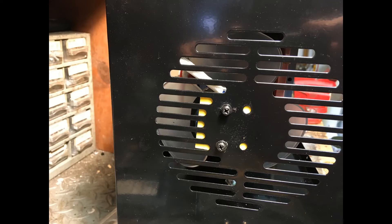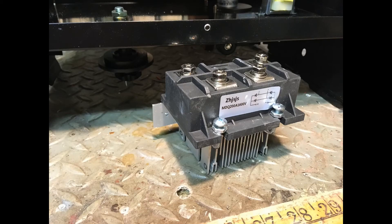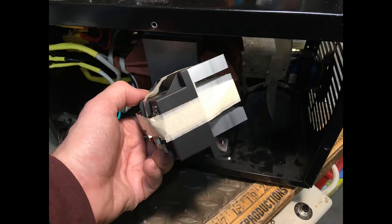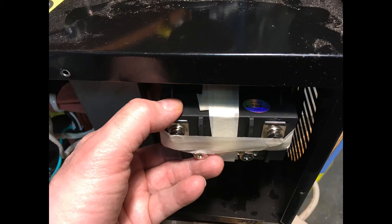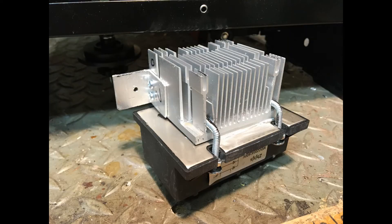But it ended up being necessary to move the fan about one-half inch to the side. The rectifier has a smooth surface on one side that is meant to sit up against a heat dissipator, like my CPU heat sink. Sometimes people convert these welders by simply screwing the rectifier to one of the sheet metal sides of the welder, but I wanted to be sure to use some kind of heat sink to dissipate as much heat as possible. I did a lot of test fitting before drilling any holes. I used some big sheet metal screws to mount one side of the rectifier to the heat sink. On the other side of the rectifier, I bent some machine screws and mounted them with some adjustable nuts to finish clamping the rectifier tightly to the heat sink.